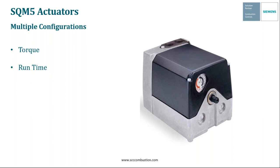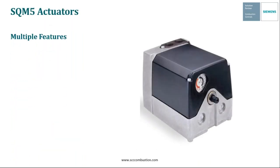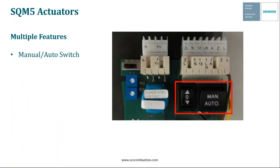There are also several different run times. For a 60 hertz motor, run time ranges for a full 90-degree stroke fall between 8 and 50 seconds — so 8 to 50 seconds to drive from fully closed to fully open. There are also several different shaft size options, including a 10-millimeter round, 3/8-inch squared, 10-millimeter D, and 14-millimeter round shaft sizes. It's important to note that the resolution of the SQM5 is about 250 steps per 90 degrees of rotation. The SQM5 can also be made to meet NEMA 4 criteria with the addition of the AGA 55.5 part number.